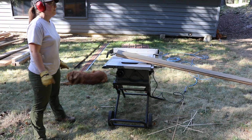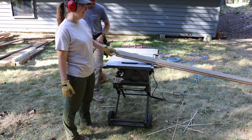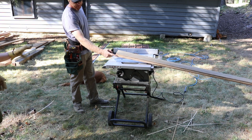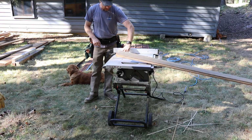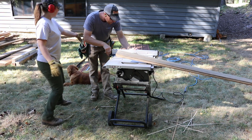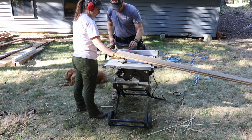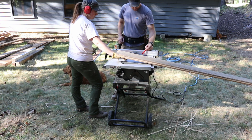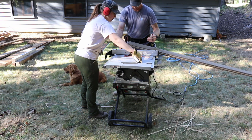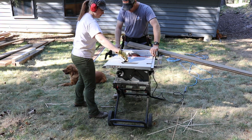I think that will be just fine. It'll be fine. Okay. Let it go. So what we could do, so that we can get a more consistent dimension off that side, would be flip these 180 degrees so our 1.5 is here. Check it. And on this, sometimes you're checking to the edge of the tooth right there, because that looks good. And then also probably check on this side. It's too far in. Give it a 16th. There we go. Okay, double check up here. Still good. Okay.